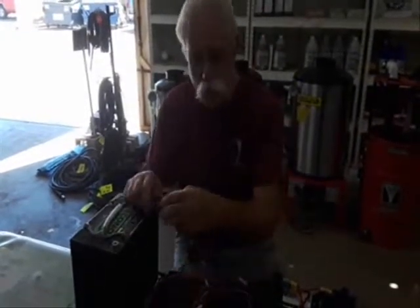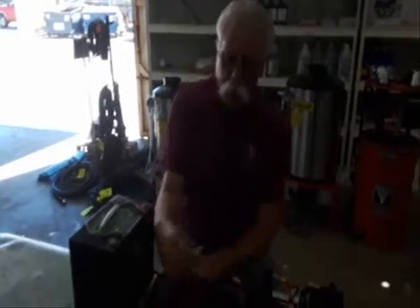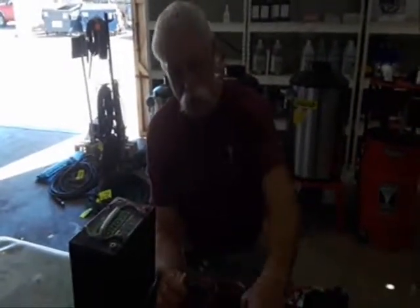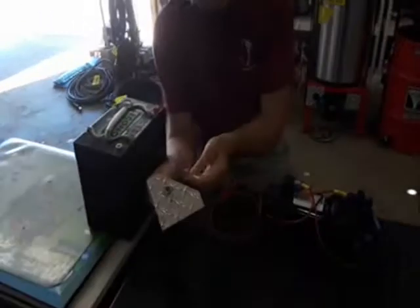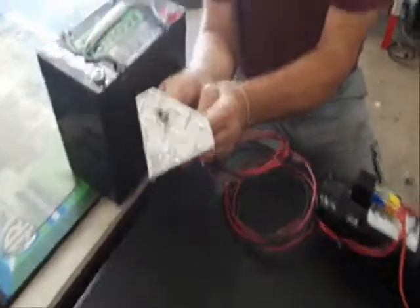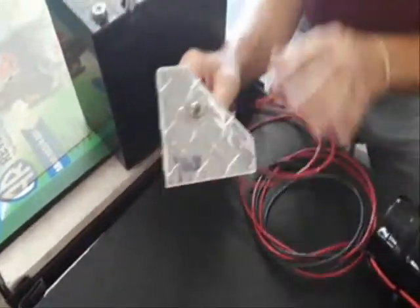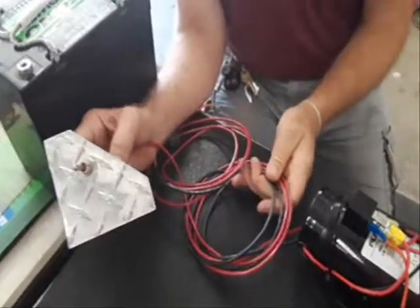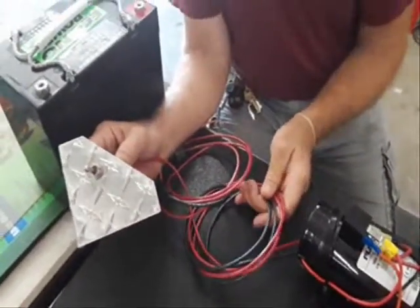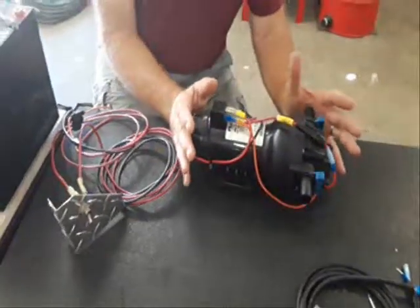This is the power to whatever you're powering. We're going to go through beefy connections to a beefy switch. This one is going to have the power switched on from the source. You can mount that conveniently. Make sure you've got perfect connections and wires laying where they're not going to get chewed up or laying across sharp objects. Then your pump has its best chance to live a long time.